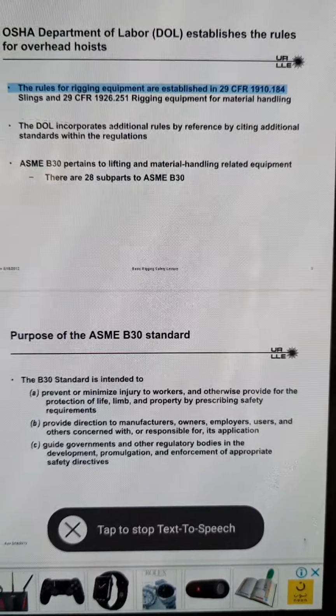Each hoist ring is load tested and comes with a factory certificate. Many different types and sizes are available. Lecture 28. The longer effective thread projection, approximately twice the thread diameter, must be used with a hoist ring threaded into aluminum. Dimensions: HOR 125, load limit, effective thread projection, working torque in ft lbs, bolt size, stock number, weight.